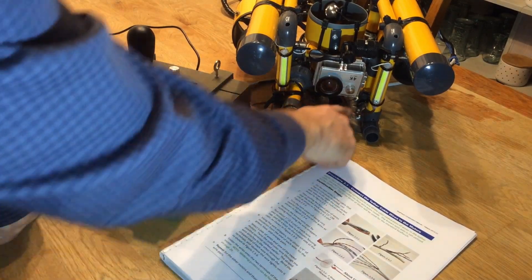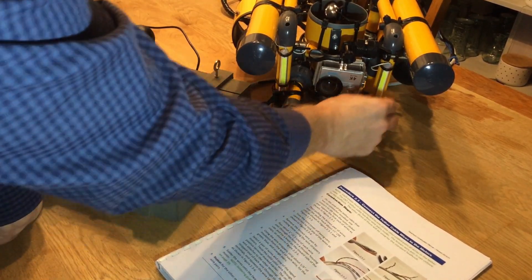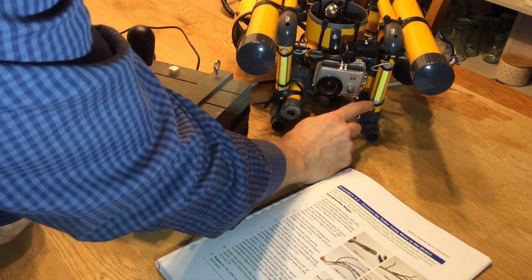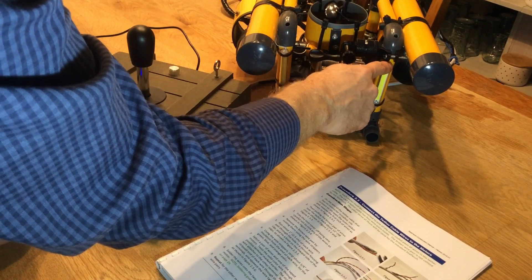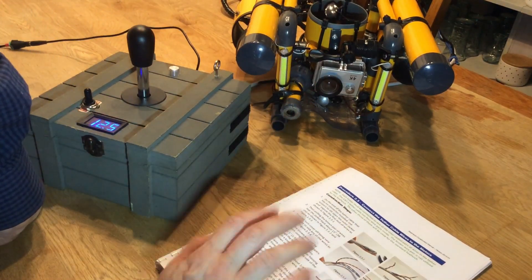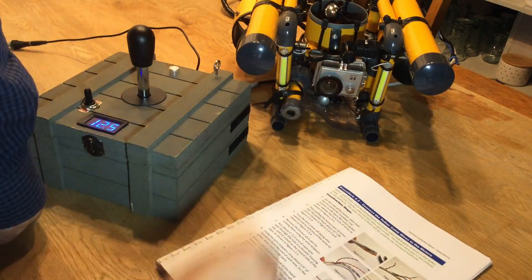This is your plus line, this is your minus line — positive and negative. You go in on one side of the first board of LEDs, entering plus on one side and leaving on the minus on the other side. Then you go to the next one — same deal, plus and minus — connected to the plus and minus of the third one. That means the current stays the same, but the voltage decreases. 12.6 divided by 3 gives you approximately 4.2 volts each.